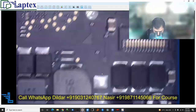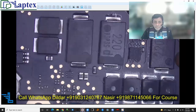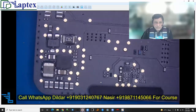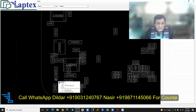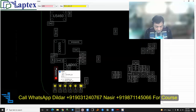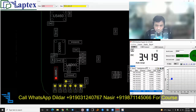Let's check whether the 3.42 volt is available on the board. We need to search the diagram. This is the charging IC area where we should get 3.42 volt. We have schematic and board view here — this is the area and there is a coil. This is the L, the G3 Hot VR voltage required. Let me check — 3.41 volt is available on this particular pin.